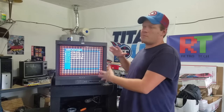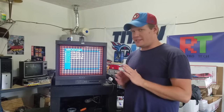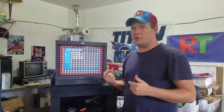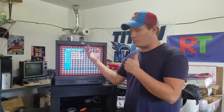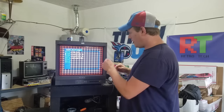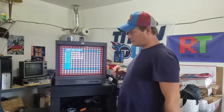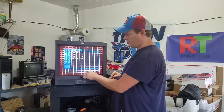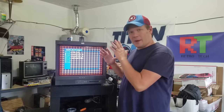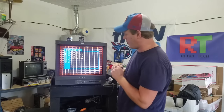We've got our menu up. This monitor doesn't need a lot of adjustments — I hope you can see how good it looks. CRTs are never really designed to have perfect geometry. So if you're looking for perfection and 3% is killing you, you'll have to get over it. 3% is like a 97% design — it's got a 3% error just built into it according to the specifications in the manual. When I get started, I like to center up the picture. The grid shows us our outline of the picture, and I like to see just an even black amount around the whole screen.